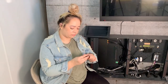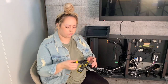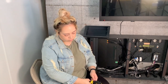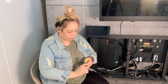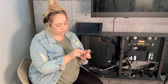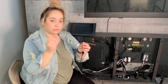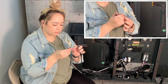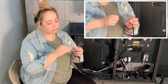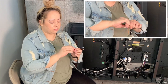This next step of adding the RJ45 connector was actually my favorite part. Before you cut, strip, and crimp, be sure to add your RJ45 boot to the cable, otherwise it's nearly impossible to add it later on. I eyeballed about an inch or so of wire and used the same tool to strip the wire jacket. Another hack — don't throw away this jacket you just took off, it will come in handy later on. Once the jacket is off, spread out all the wires to look like a starfish and carefully use the scissors to cut out the plastic guard in the middle. Here's where the extra jacket piece comes into play. Instead of untwisting the wires by hand, use this jacket. Simply pull the end of one twisted pair free with your nail and slide it into the jacket, then just twist the jacket along the wire until it's free. The jacket is also helpful because you can use it to pull the wire straight after you untwist it. Big thanks to Tyler for showing me this trick.